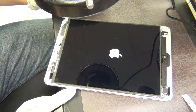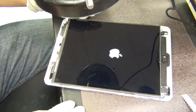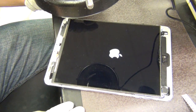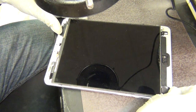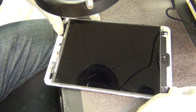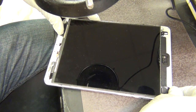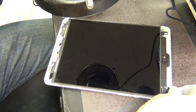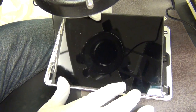If the filter doesn't work out, then you have to change the diode and the coils, and you want to test if any of the backlight track is grounded. If it is grounded, then the board is too far beyond damage. If you do have any track damage, it's possible to jump it — bridging the connections may fix it.